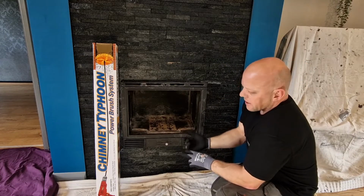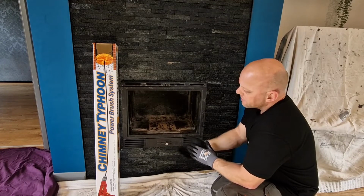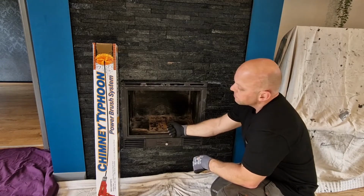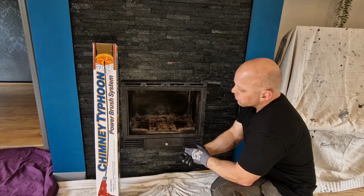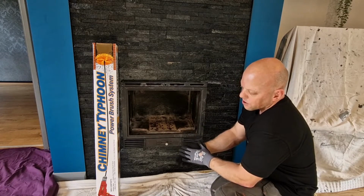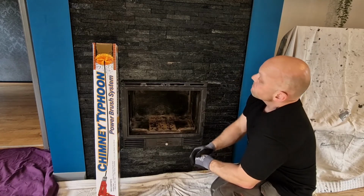The second thing is take your time with the drill and make sure you put something between your hand and the actual rods if you're going to support them, because the last thing you want is your glove or your skin to grip the rod. You're going to end up with friction burns. So like I did in the video, something like a bit of kitchen roll is ideal.